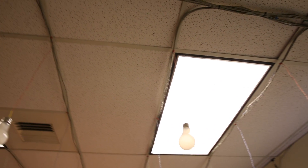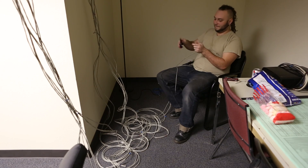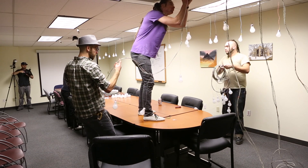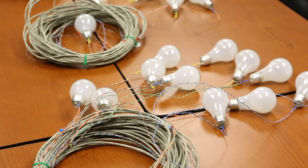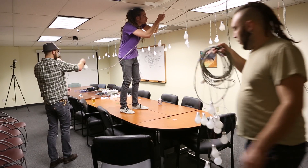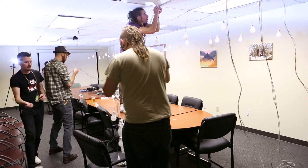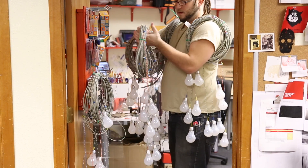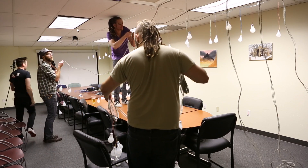The wiring harnesses are all cat5 cables — just networking cable. We bought a big box of about 1,000 feet of cat5 riser, measured it all out, zipped it together with zip ties, and separated out all the strands for each bulb in my office. Then we came in one night to the conference room after work hours. I got a couple of guys to help run all the wires along the ceiling and drop them where the light bulbs were going to be. I came in with big rolls of wire that had the light bulbs already soldered in place — all we had to do was hang it. All of the wires run back up to the main cabinet and into the TLC5940 boards. It's a big bundle of wire at one end of the room, but it's actually not that noticeable because of the layer of light bulbs attacking your field of vision.